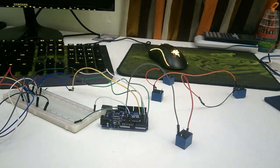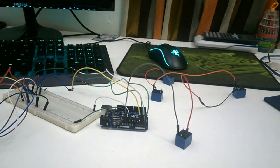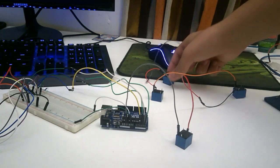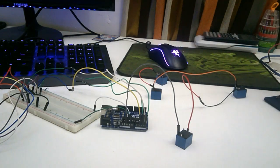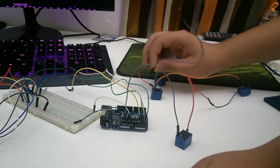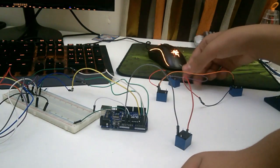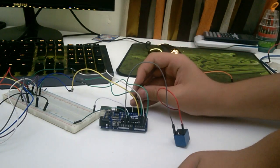Okay, now we're going to add the specific coding for each individual relay, so that it will tap the tiles in Piano Tiles. So on the one which is at the end of the wires that we connected with the relays together, there is a single piece of pin that's just standing out. So we're going to connect a male to female wire, female first, to a male to port 6.